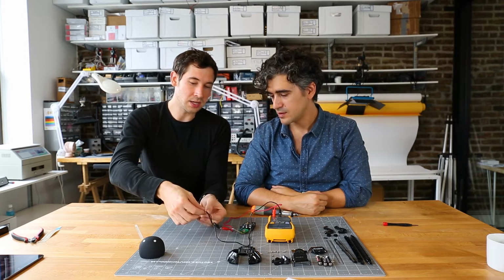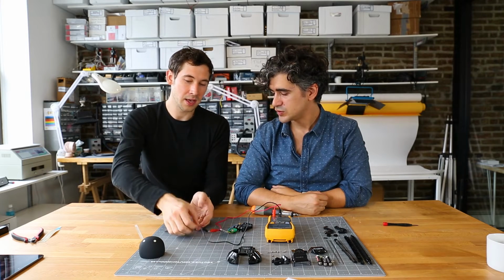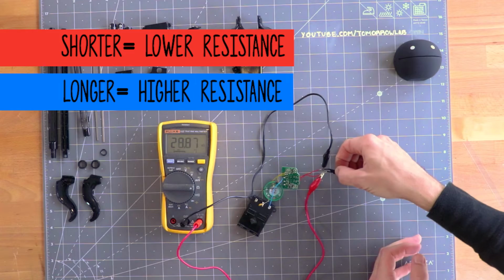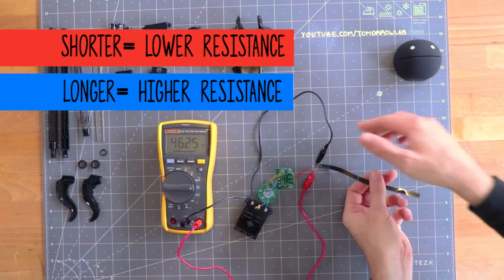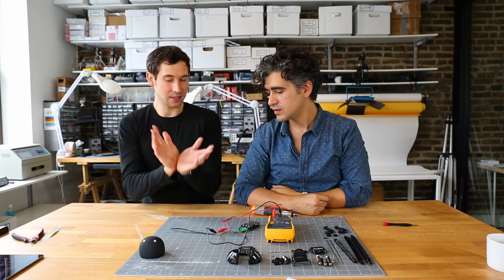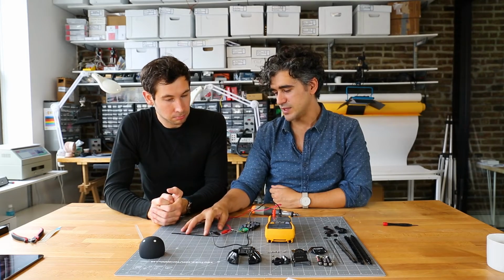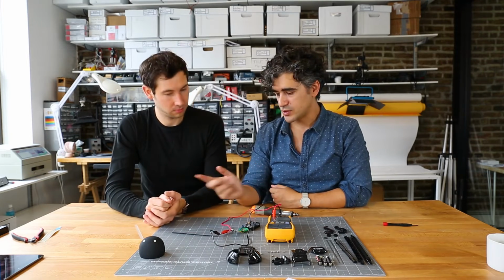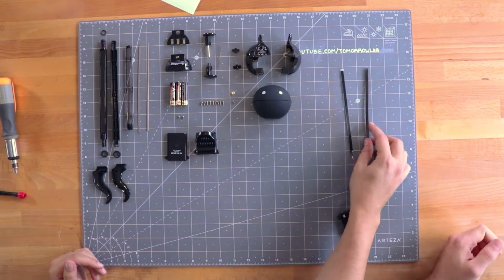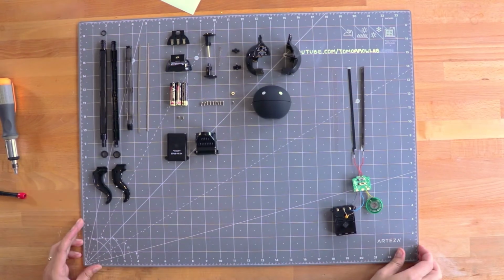And so this sheet looks like essentially a sheet of Velostat folded in half. And so as you short it near the two ends where they connect, you'll get lower resistance. And if you short it on the other side, that's a longer span, and so the resistance is higher. So you just change the length of the resistive material, and the loop gets shorter and longer. That's cool. It's more like a water wheel or a mechanical system rather than a really simple digital system.